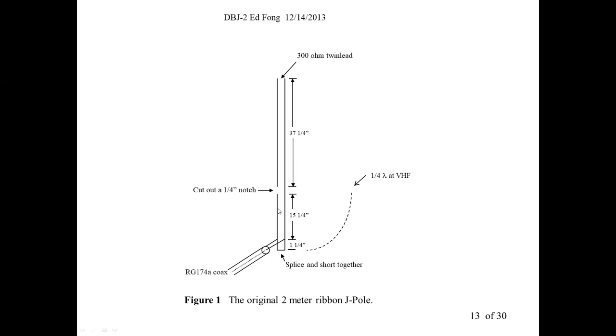You need some type of impedance matching system. I just showed you about that quarter wave stub. If you short circuit it on one end and go up a quarter wave, it would be an open circuit, a very, very high impedance. So it'll go from zero to, equivalently, thousands of ohms up there, which will match great with the other end of that dipole.